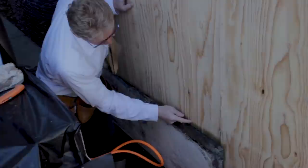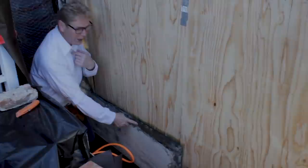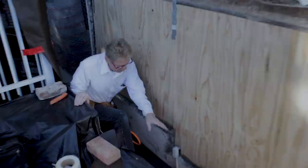We're going to bring our paper right to here, staple the wire on, and this concrete is going to show. What we did is take a wire brush and clean it out. This blue stuff here is a bonding agent — you'll see it when we get to that stage. The bonding agent is necessary for the stucco to adhere.